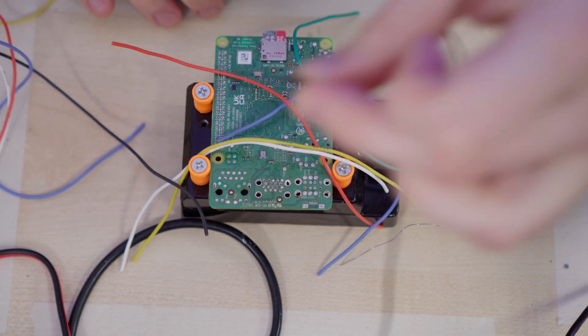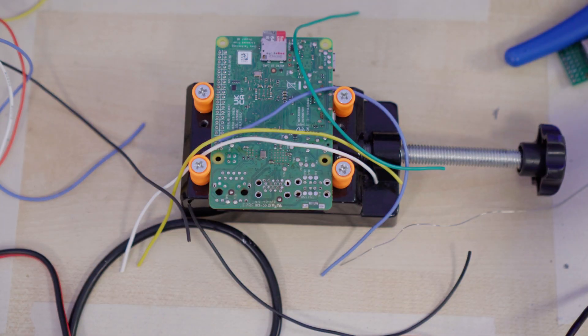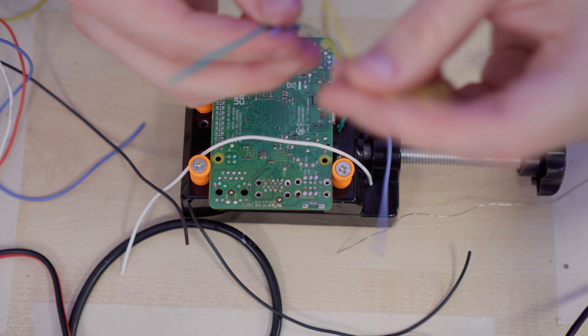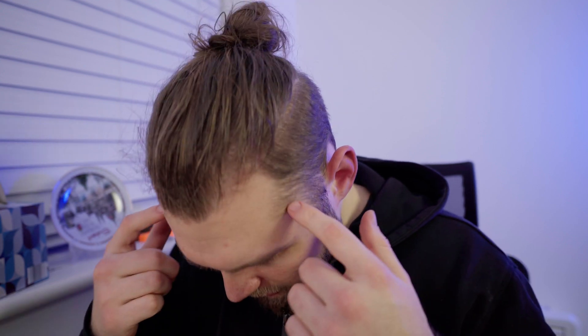That's six, so I need three more. I've got my two grounds here, then this is the V-bus, so that's done. And now I need data plus and data minus, so I'll cut two more white ones. The minus will be white and the various pluses will be colored — I think yellow is going to be data, just because that's usually what they do in USB. Then I tinned the ends to make it easier to solder and went ahead with the procedure.